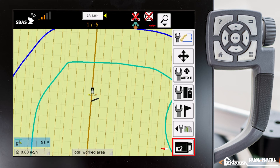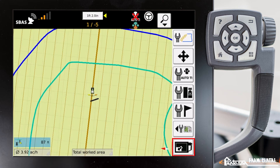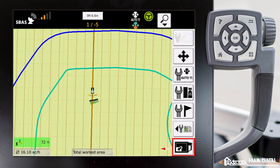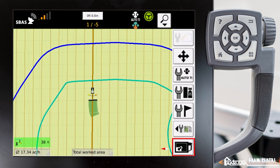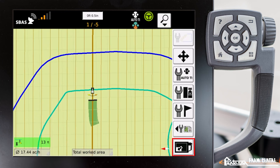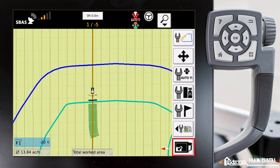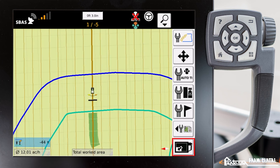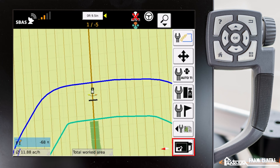Now I'm going to get some ground speed with the tractor. I'm going to go ahead and hit my go one button. That has enabled my auto steer and now I'm doing six miles per hour. As I reach that teal line, my end one button will activate. My tractor has disengaged auto steer and now I'm doing four miles per hour. Now I'll go ahead and manually turn around to my next row.